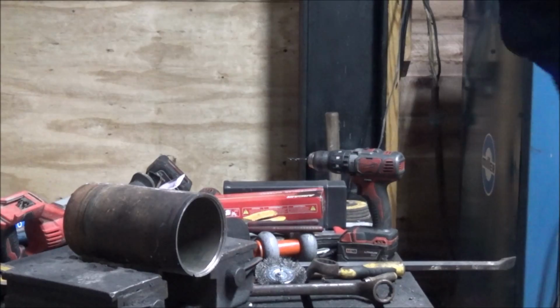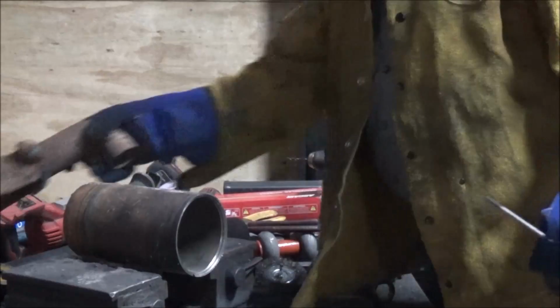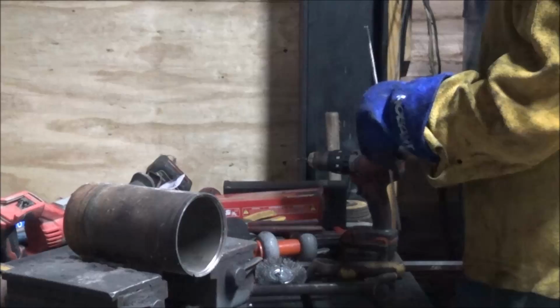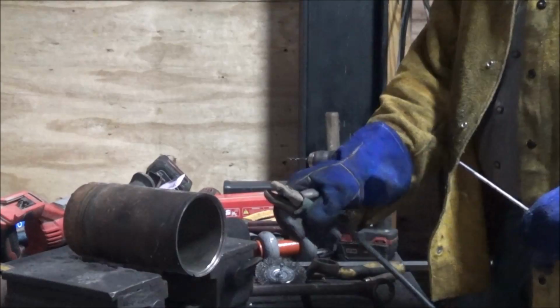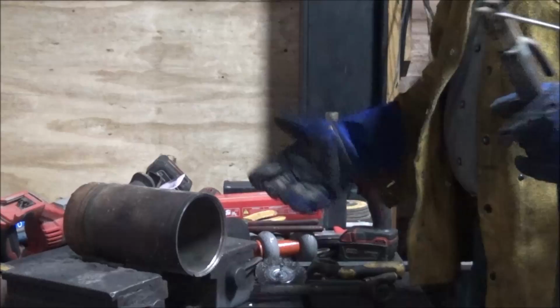Pretty strong. Everybody loves it when I beat on this drill table because it's a precision instrument. Of course, it's got more holes in it than the craters of the moon where it's been drilled on for 75 years, but some people still like to give grief about it. Anyway, let's fire the welder up. I'm using the foot pedal to run the amps, which is kind of odd too, but I'm liking it. I think this might really work well for out of position welding back in the hole, because I can really control the heat, going on and off. I don't get any slag in my welds, because all the flux is gone. So let's hit it and see what it gets.